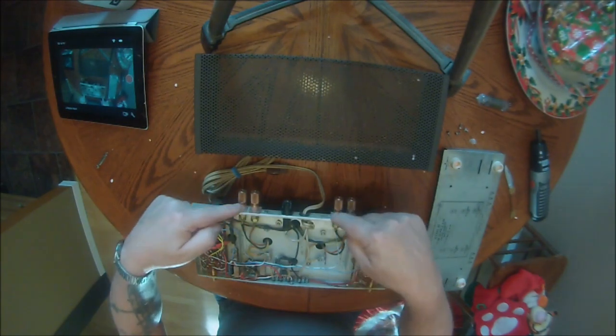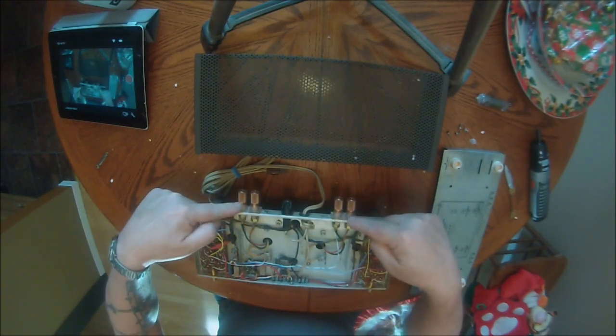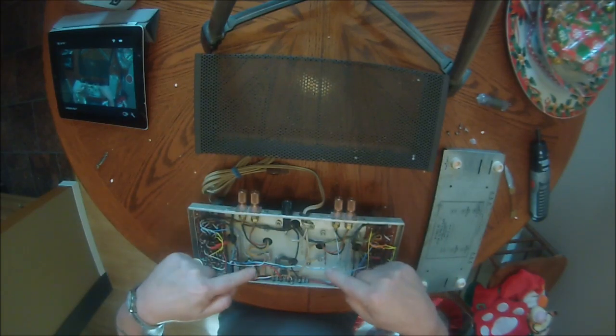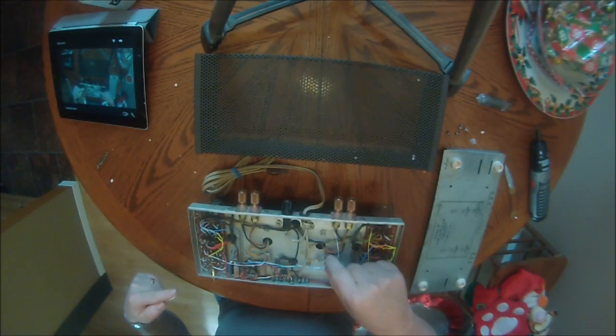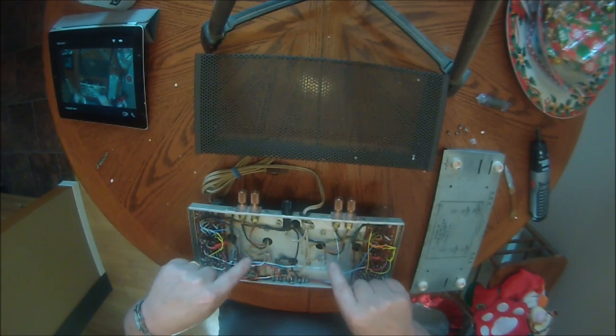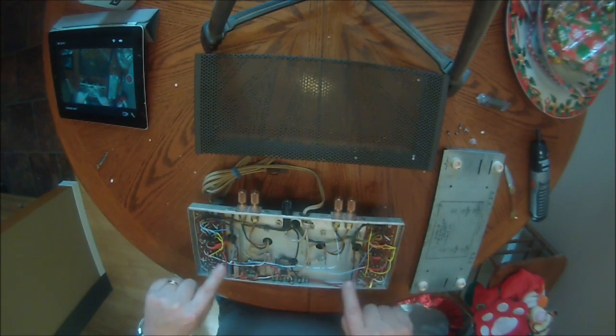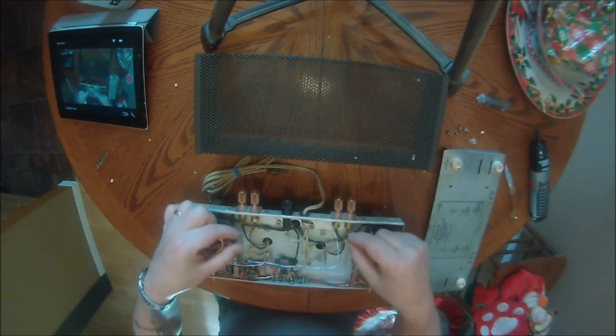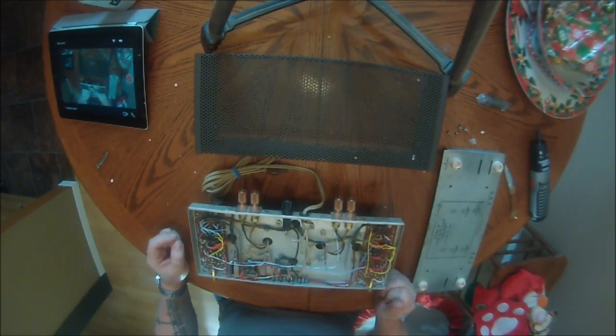Also what's happening is now there's only an 8 ohm tap and a common. So the ground and 8 ohm positive for the speakers. The 16 ohm tap has been moved over to here. So you can see they put a small terminal board, attach it to there, and they wired up the output transformers. Wire to there, so instead of being wired up over here, it's wired up over here. So they retain the connection, we just moved it inwards into the tube amplifier.